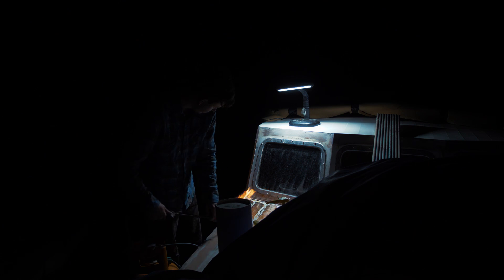I spotted there's a small leak in the forward cabin roof. It's actually because the cover is leaking a small bit, so it just sieves its way through on the join of the cover. I put down a lot of waterproof material on the roof and that stopped any water soaking its way into the bare timber.